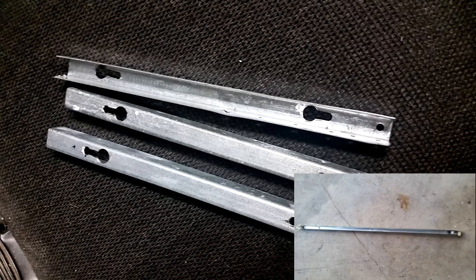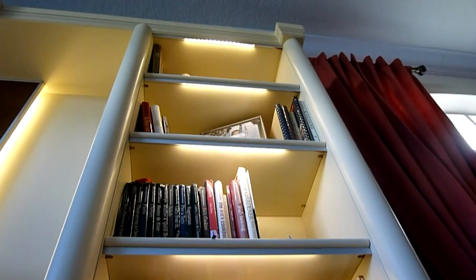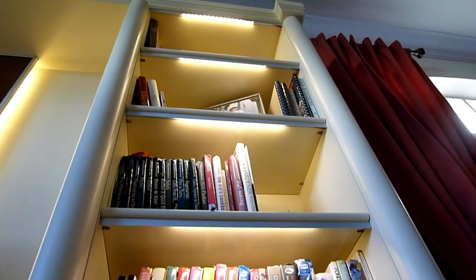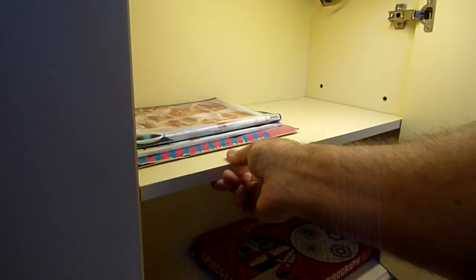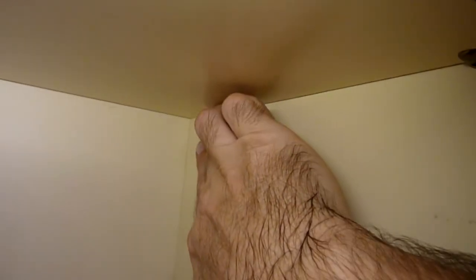To accommodate that, I put in screws every 6 inches on the 2x4 down the side and created some brackets from some old window lifts with keyholes that fit over the screws. With the towers being closer together, the shelves are now much smaller and less likely to warp. The original shelves had a tendency to slide on the pins, so I inset the wood so that they would sit down on the pins, preventing the wood from sliding.